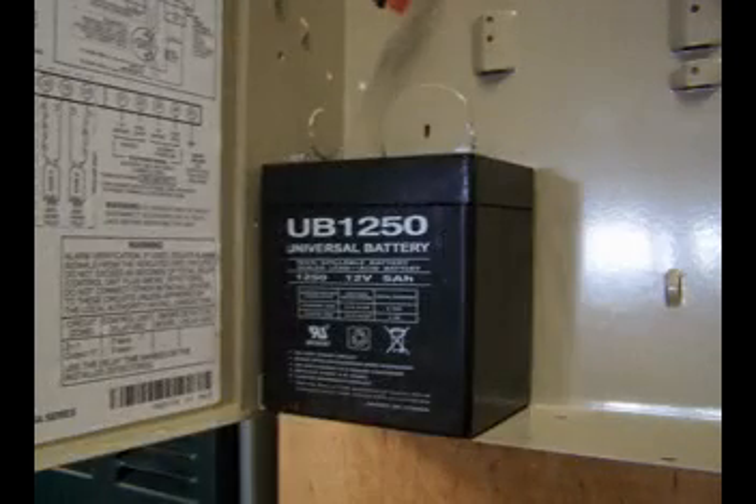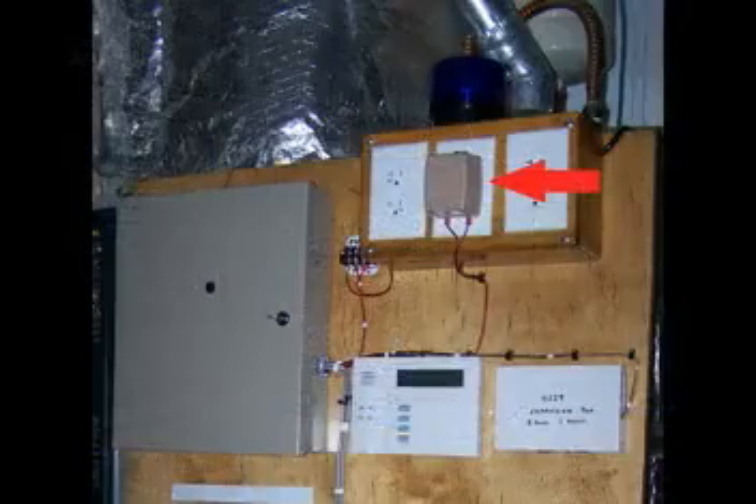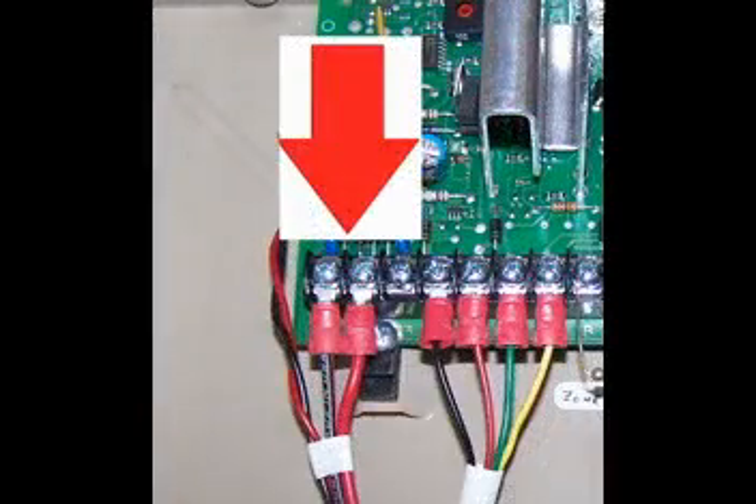You could move, or you could ask the alarm panel to tell you what the new code is. Go to the alarm box and disconnect the battery, then disconnect the power transformer. If you don't know where the transformer is, go inside the panel and on the far left-hand side you'll find two contacts — this is where your main AC power comes in. Just disconnect one of the wires. Your goal is to completely remove power from the alarm box.